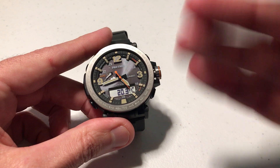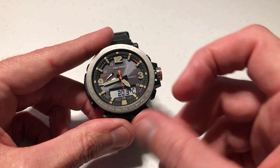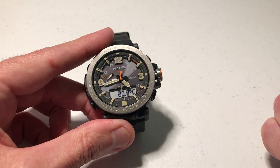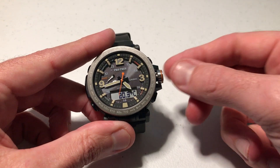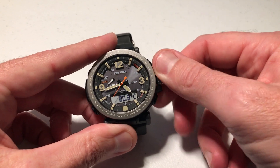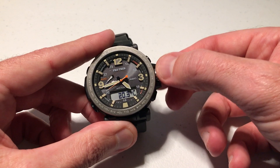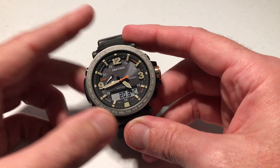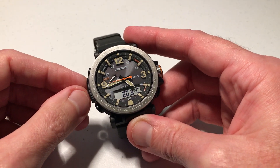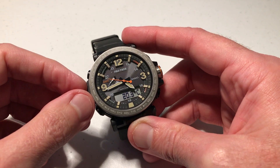A really cool feature. I wish Garmin and other companies would let you do that. Casio is the only company I know of that will actually let you go and adjust your thermometer sensor on your watch. Last thing we need to do is screw the crown back in. As with all watches that have a screw down crown, you don't want to leave that crown unscrewed. And that is how we do a temperature sensor calibration on our Casio ProTrek PRG600 watch. As always, I hope the video helps. Thanks for watching.